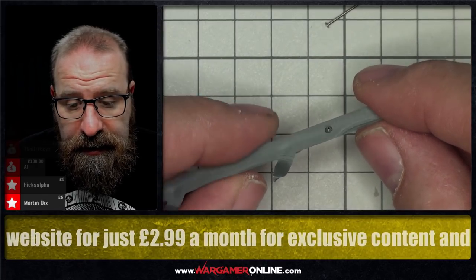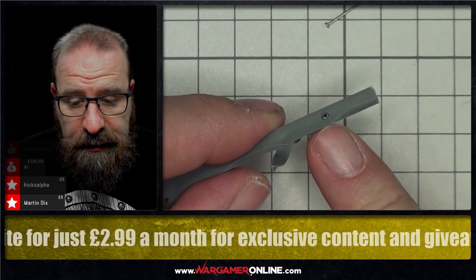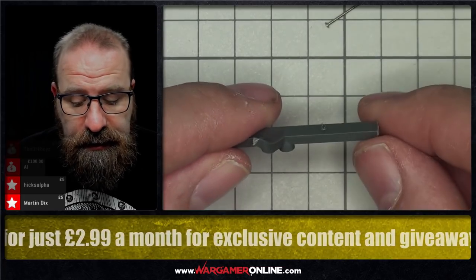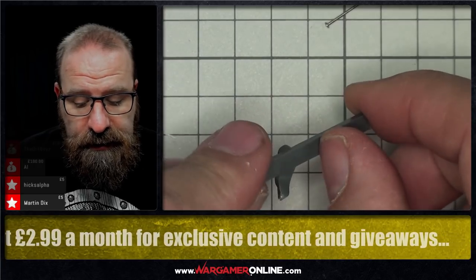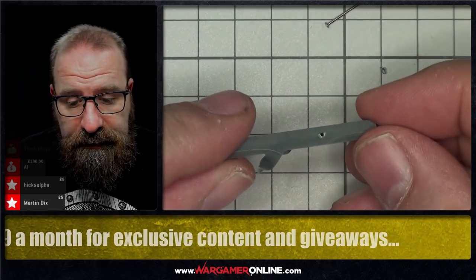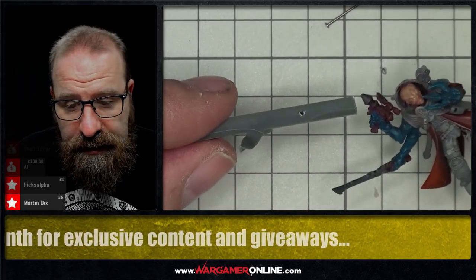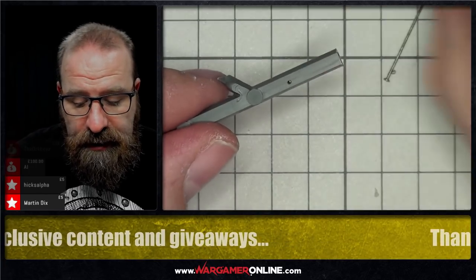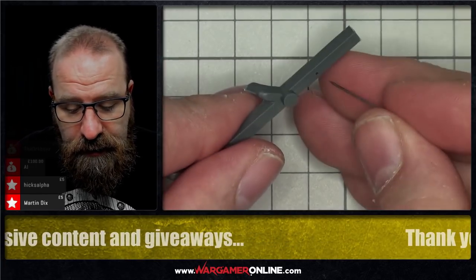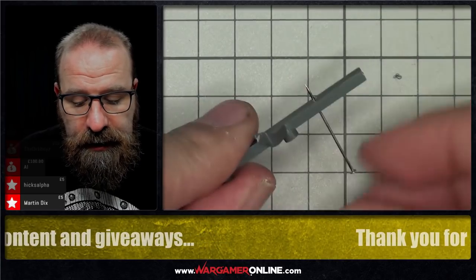But what's happened on this side? Essentially, just like when you drill a hole out, the excess material's got to come out somewhere. So it actually comes out of that top surface there, and as you can see, it's created a little bobble. The simplest thing to do is, once it's cooled, literally flick that off — and there you go. Now obviously, when it comes to doing this fellow, I'm going to be a little bit more careful about that. But as you can see, now I've got a lovely hole, very fine, almost no work involved whatsoever. I'll be able to push in a pin and secure it.